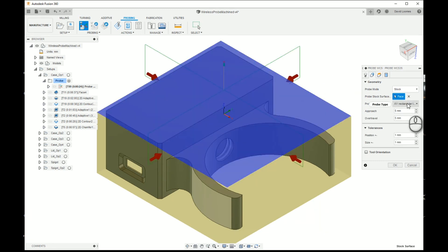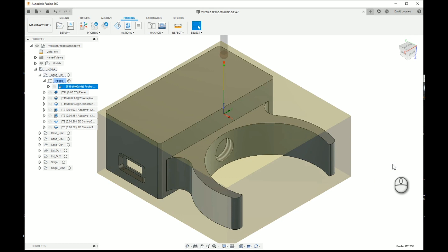I want the selected surface rather than the rectangular box. The approach distance of five millimetres is the distance away from the expected touch that Fusion will slow the mill down to the probing speed. The over travel of five millimetres is how far past the expected point it's prepared to go. If it encounters any touches before the five millimetre approach distance, or it doesn't encounter one by five millimetres past the expected point, then it will abort the program. Click OK and that's that done.